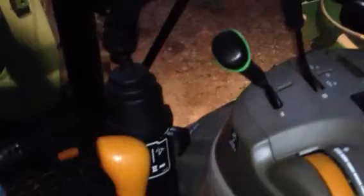These are your main gears and your range lever down here. Now that's one thing I don't like about the ranges, they are not synchronized. So you have to come to a complete stop or they grind. 6000 series is not that way. Now I think on the new 5100Ms, the ones that's replacing this tractor, has synchronized ranges, so that is an improvement.